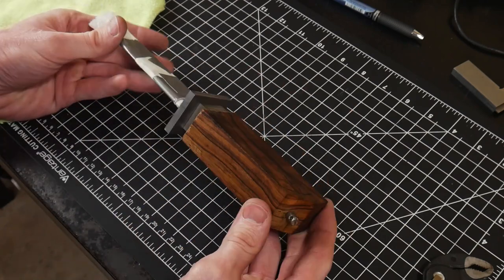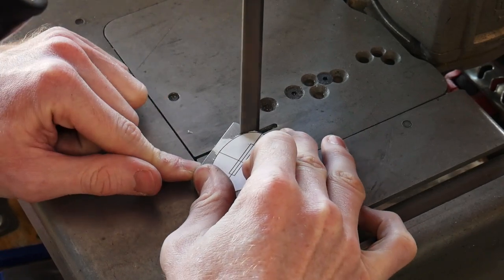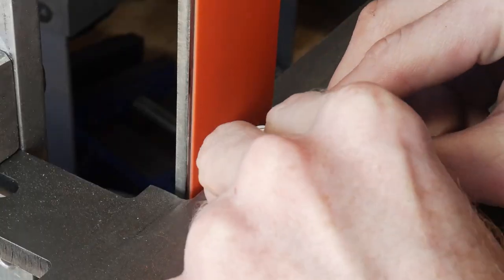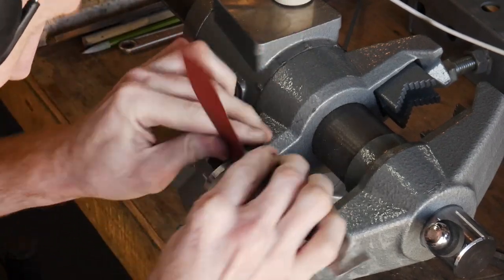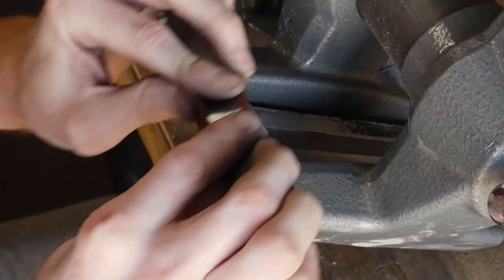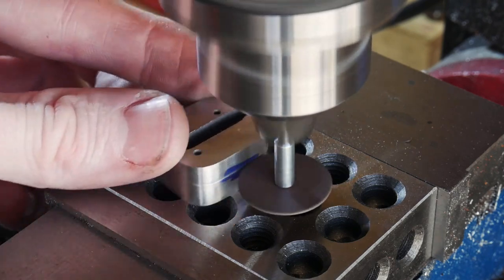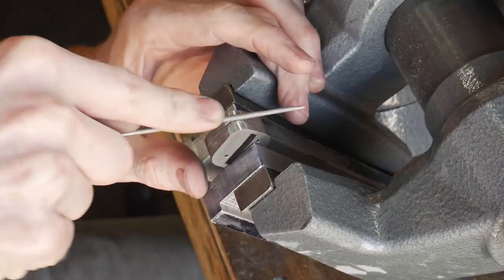At this point I decided to shape my guard and spacer. I measured the height and width of each, went into nanoCAD, drew out my desired profile for both, glued that template onto the guard and spacer material, and then ground down to my desired lines. Once I had the profile rough ground out I went to the hand sanding bench and sanded the profiles up to a 320 grit finish. I also decided to put a decorative groove into my spacer material, so to get a starting line I used a dremel tool attachment set up in my mini mill to scribe a groove all the way around the spacer.